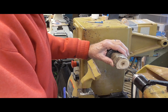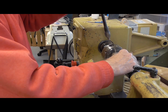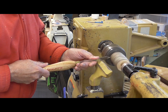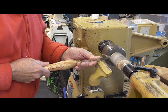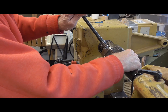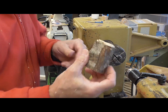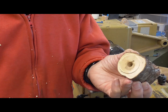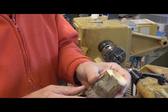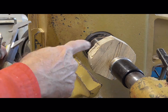One thing I want to do is to put a little ring around the top. I'm going to loosen it from the spigot chuck a bit and use the same parting tool so that the top sits square and flat on the top of the birdhouse. So now I have something that looks like this. It's a hollowed out piece of log with a hole in the bottom for a finial, and I'm ready to turn the top.